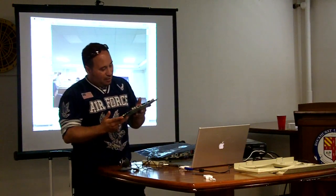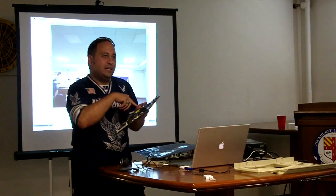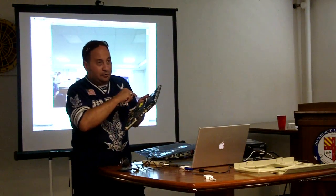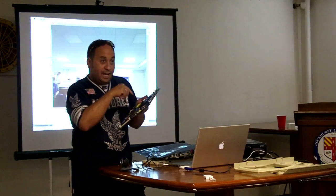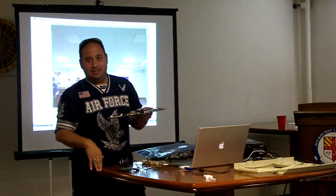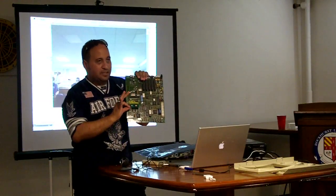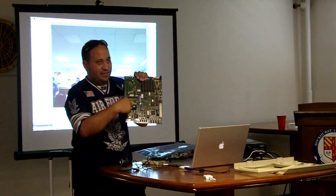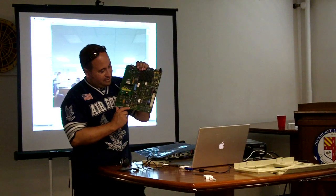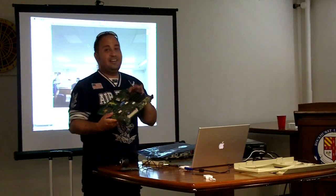So you probably programmed up the machine to install it. Maybe somebody spotted it and said this can't possibly work, because usually the pad for pin number 1 is different. But in this case, the pad for pin number 1 is correct but in the wrong position. It's indicated in the wrong position. If you put this IC down, it goes off the board. So rather than start over, you made a small board, and every single wire ran. Wow. Forgot some capacitors on the RAM, so they add it on top. Stuff happens.